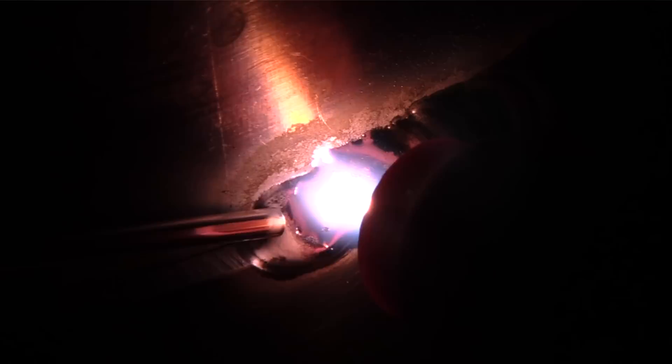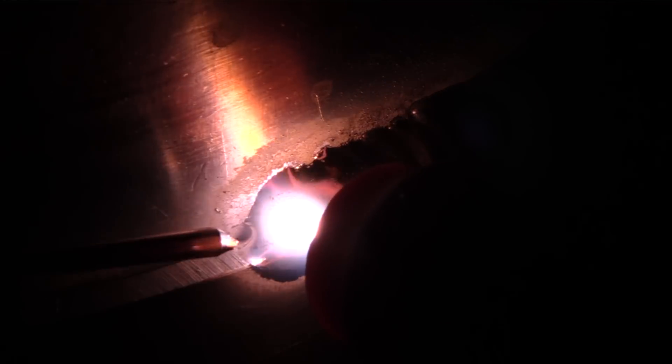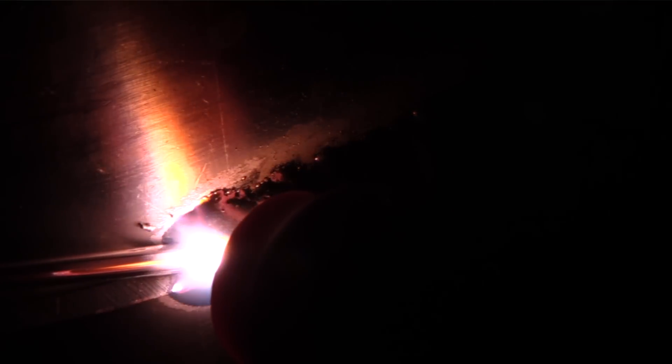You could see while I was welding that bead that it wasn't really super clean — there was no evidence of cleaning action, no frosty looking area beyond the toes of the weld. It was right at the toe of the weld. You could see some little areas where it just looked like it didn't bite. It looked like a solder joint where you ran out of flux and the solder ran up to that area and it wouldn't flow any further.